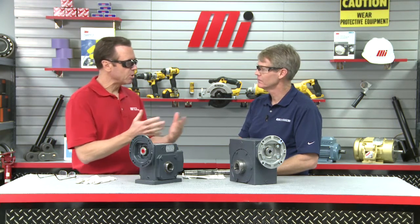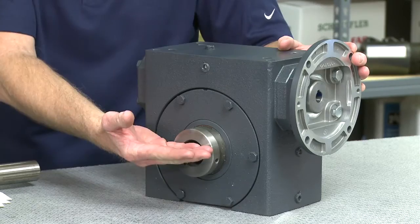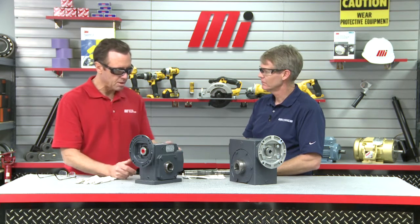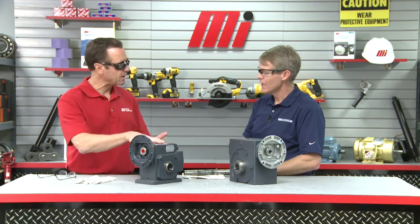I need to be able to install this without re-drilling or modifying my machine. How is that possible? Remember center distance? All worm speed reducers are classified by center distances, and along with those center distances come standard parameters. First would be base to center height — from the base of the gearbox to the center of the output shaft. Second is the width and length of the bolt hole patterns. And finally, the output shaft diameter. We're going to make it work with two accessory kits to make this HERA 45 take the place of the 3.25 center distance worm.